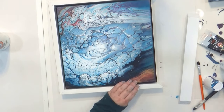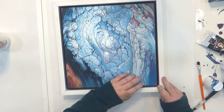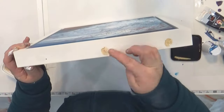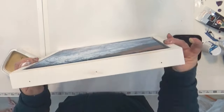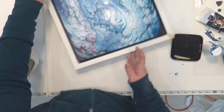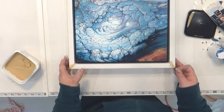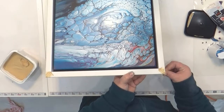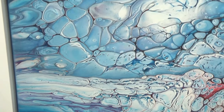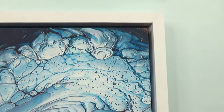I was able to cut all of these pieces from a single one-by-two by eight-foot piece of lumber with extra left over. You can buy one piece of pre-primed one-by-two lumber for under four dollars. Next I used wood filler to fill all the little holes and gaps on the mitered corners. After letting that dry and sanding it, I gave the frame two coats of paint and it was finished. I'm really pleased with it — it has the same overall look as a floater frame, but the ones for a 12 by 12 canvas cost about $50, and this one cost me under four dollars.